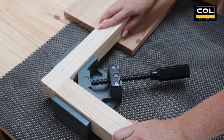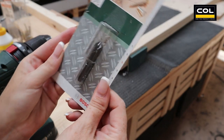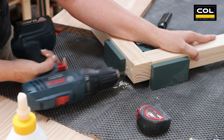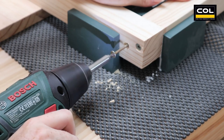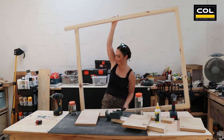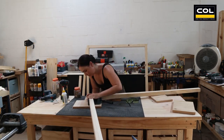I'm making use of a handy corner clamp that's going to help hold the wood together while I drill in two pilot holes. Then I'm using a countersink bit so I can bury the screw heads and cover them later with wood filler. Driving in long wood screws and applying wood glue first to the joints and then securing these pieces together. That is one square frame done. You can see I left some legs for the bottom.